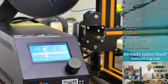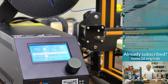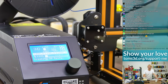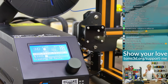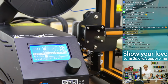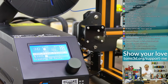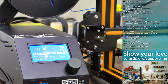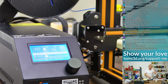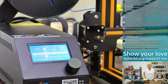I don't like printing straight to glass. If it's just pure glass, I find that to be very sensitive to your finger grease, etc. You do have to wipe it down before every print. You do have to make sure it is meticulously clean, and sometimes when you're just printing PLA, it doesn't stick well enough, I feel. So I've actually moved to just using any sort of specialty adhesive on glass. If it's 3D lac or something, that stuff is just always going to stick.